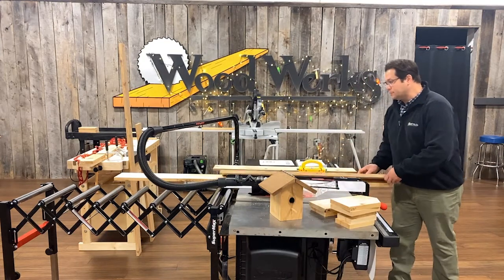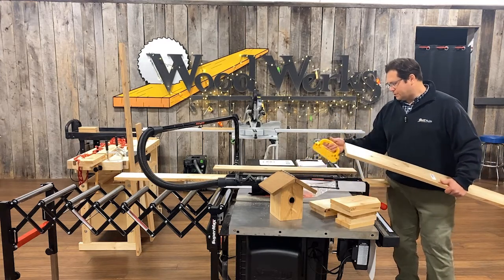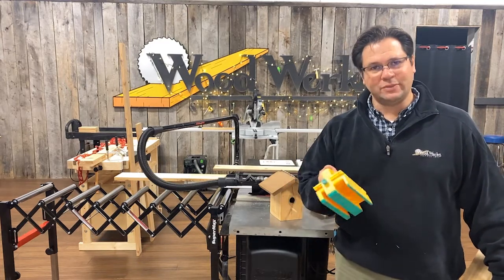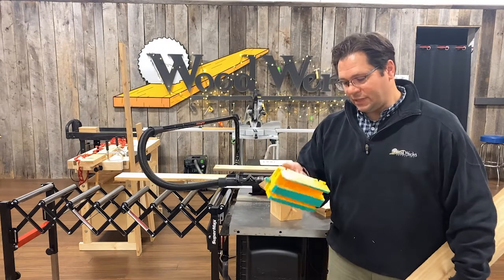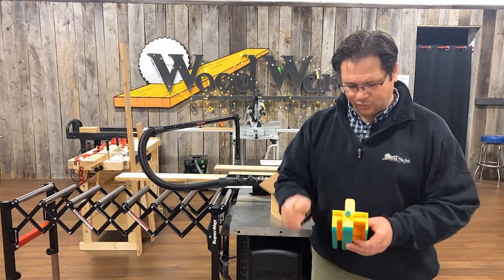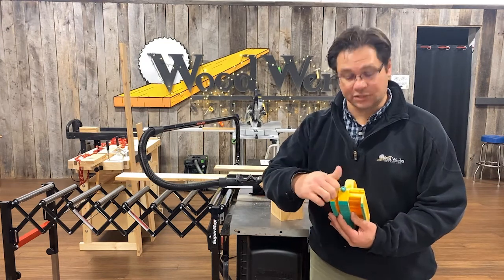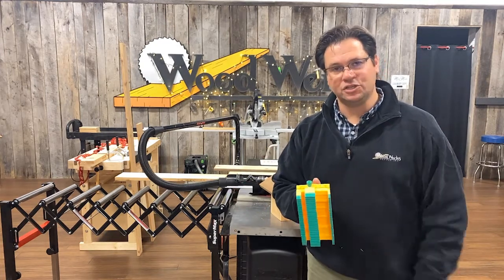Working with my western red cedar, I've got a couple of longer pieces and my saw set up to the 30 degree bevel. I'm also using the Gripper Micro Jig, which has a grippy surface on the bottom that helps me keep control of my piece whether on a router table or table saw. It keeps my hand elevated and out of the way, fingers away from the blade. It's got an adjustable center shoe so whether I'm ripping a narrow or wider piece, I can adjust it to make a path for the blade — keeping me totally protected with my hand up on the handle while the blade is underneath that shield.